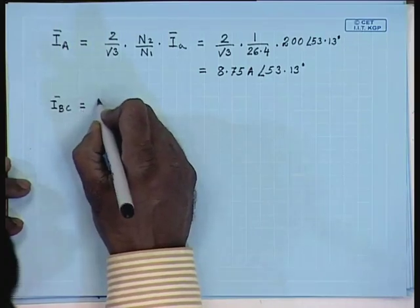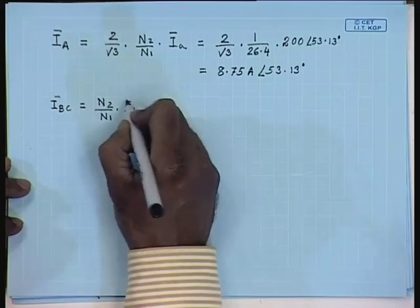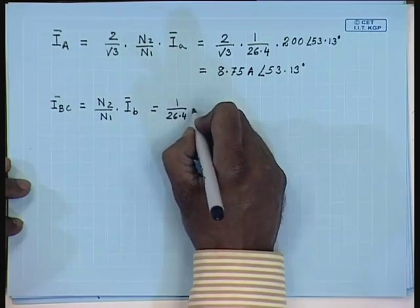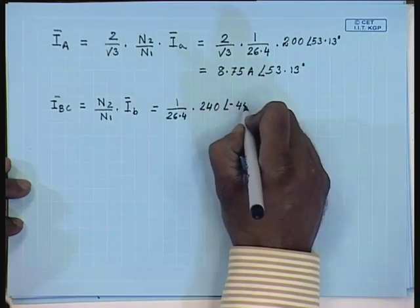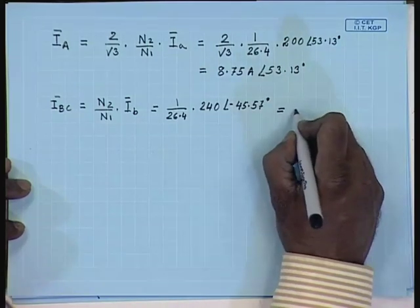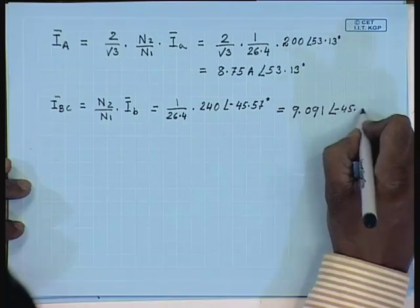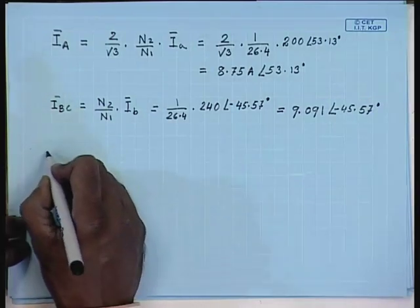will be equal to N2 by N1 into I_B. Hence, this will be 1 by 26.4 into 240 angle minus 45.57 degrees. This comes to 9.091 angle minus 45.57 degrees. Therefore, the current I_B